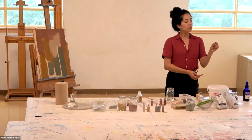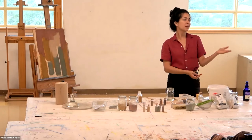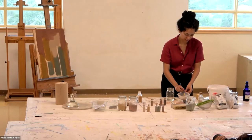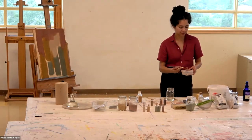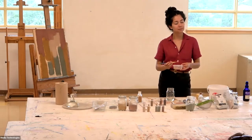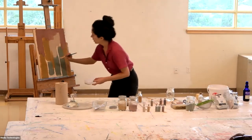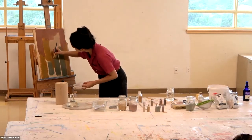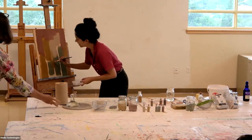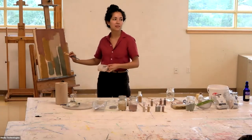Then you put about three-fourths inch — you could put it thicker but sometimes it'll crack more. It's using water to get the right consistency. I have used emulsified asphalt before for mud plastering — it smells like sulfur, it's super gross, and you don't want to get it on your skin or your clothes.